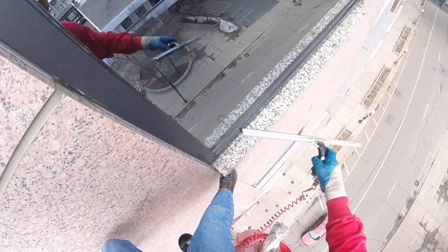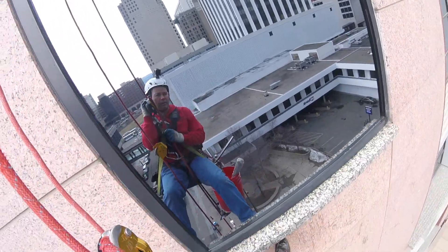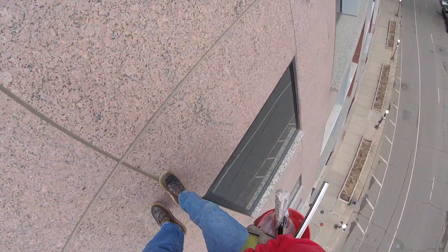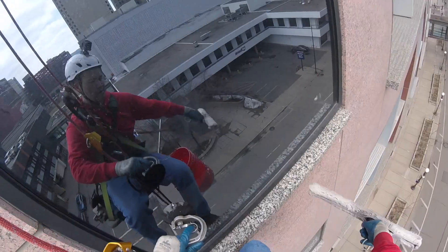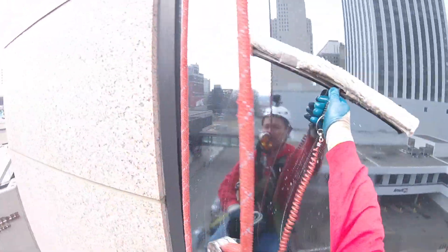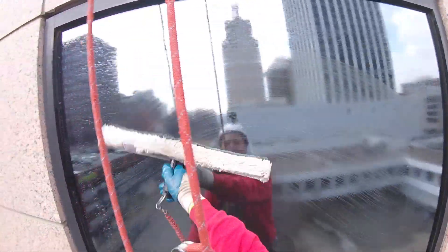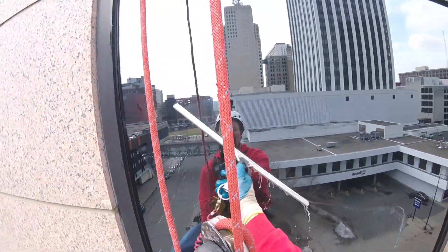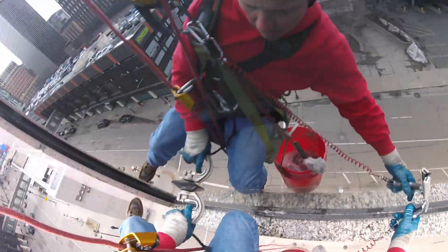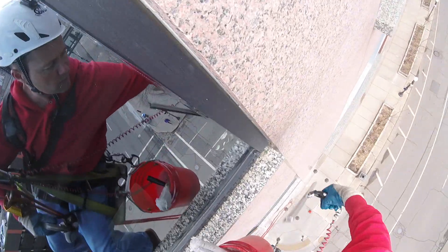As we use the suction cup, the farther down we get, we get more sway. To stabilize us, we're going to use that suction cup for longer periods of time before we close out. I'm grabbing my cup onto the window, off the window, scrubbing it, and the cup goes back on the window for support. That cup helps stabilize me and give pressure to the window. If I scrub without the suction cup on the window, it's going to push me away — I'll have less scrubbing power and it'll take longer. So using that suction cup to generate force to the window with the scrubber is very helpful. You can see the suction cup stayed on the window longer than on the previous window.